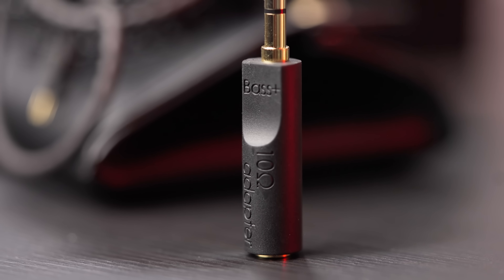Why 10 ohms? Why not 20 or 30? First, I think the 10-ohm resistor still results in a rather substantial bass boost — I think this is the sweet spot, and anything more breaks the balance altogether. Second, you get less volume loss. Sure, you get more bass with a 20 or 30-ohm resistor, but it gets harder to drive. My thinking was: put the 10-ohm in the package so it's still relatively easy to drive. The last point is that you really can't find this low of an impedance adapter on the market today — the lowest I've seen online was 18 ohms, and most start around 25.